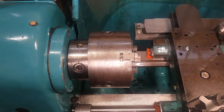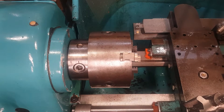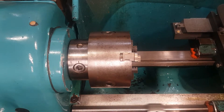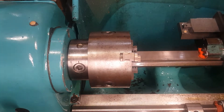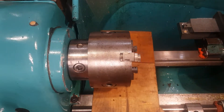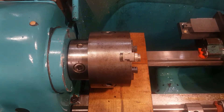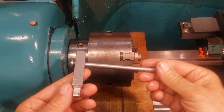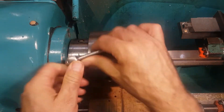First off, I run my carriage back so it's nice and clear. I move the bed stop just to slide it over to have it clear. Then I always have a piece of wood which I put on the bed, just in case I drop the chuck so it doesn't fall. Then I have my special key which is specially made for this cam lock.